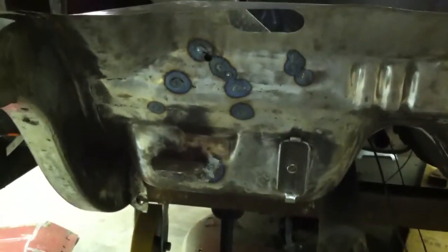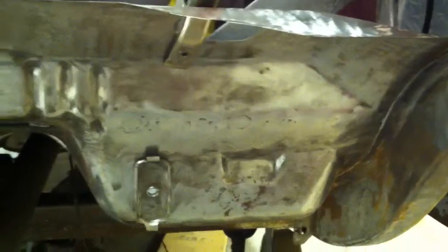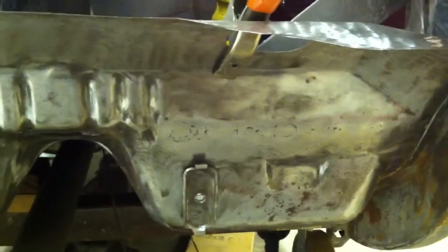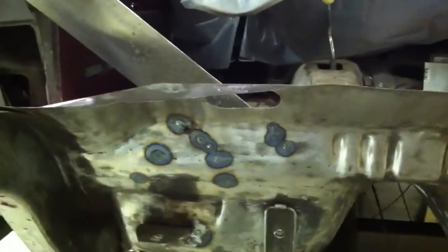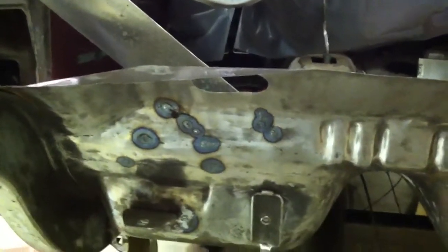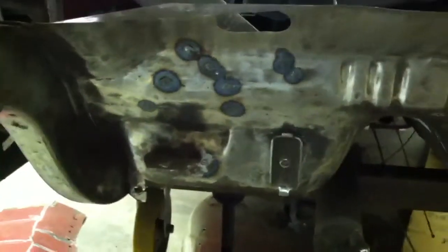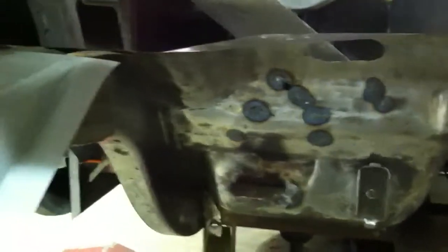Another piece I've been working on is this piece back here. There were quite a lot of little holes in it and I've spent a lot of time patching it up. There are about a dozen little holes on that side that I've cut out and welded in one-inch diameter steel discs, then seam welded it and ground it down flat so you can't tell it's ever been repaired. I've welded some in on that side too — the blue is just from the heat of welding, and a little sanding will make that discoloration go away instantly. The rest of the frame rail is actually in excellent shape.